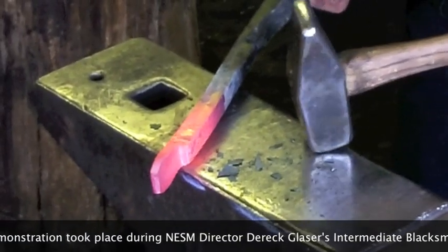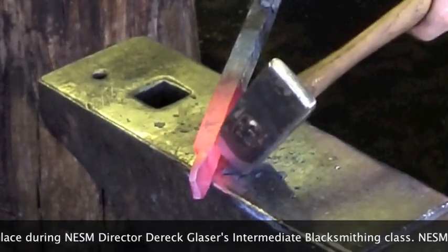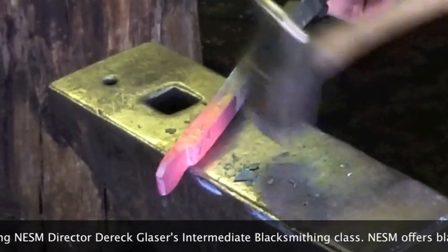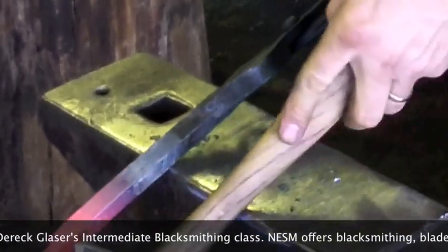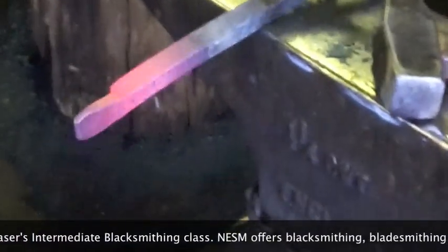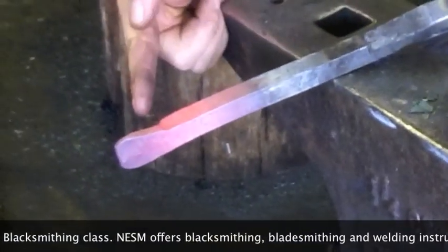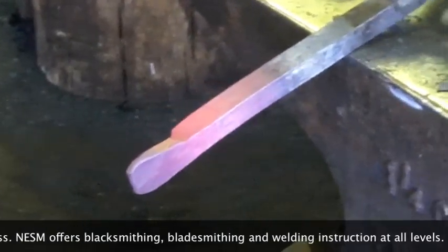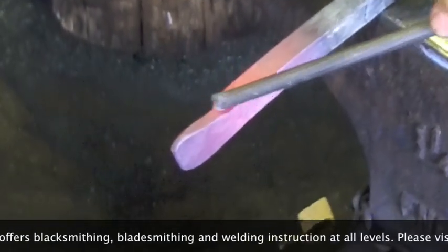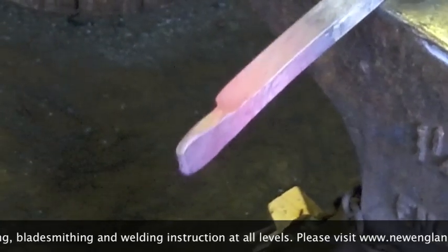With a little bit of heat left, I'll use that just to make my mark on the other side, so I know where to come next time. That's where the second offset will be. The offset you make there should kind of mirror and be symmetric to the shoulder you just made. Can you see that? See how it makes a little dull point.